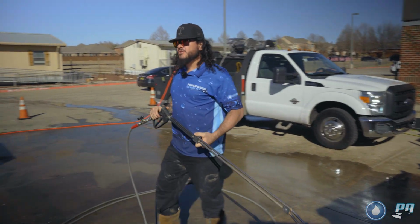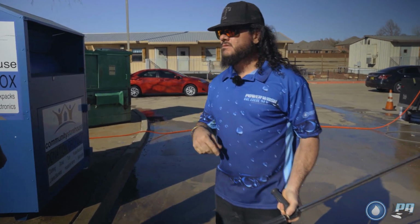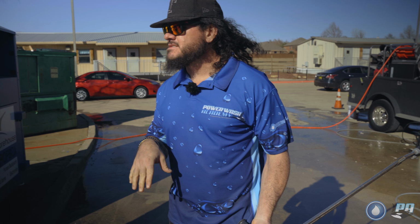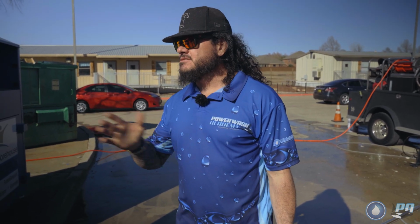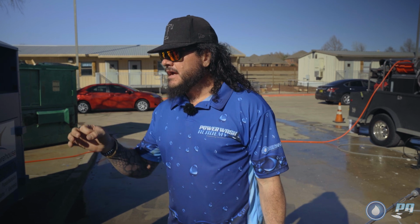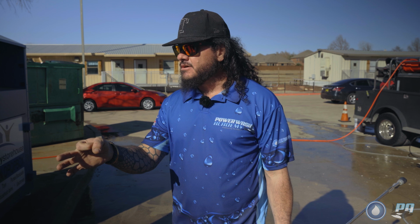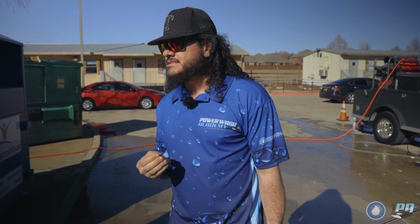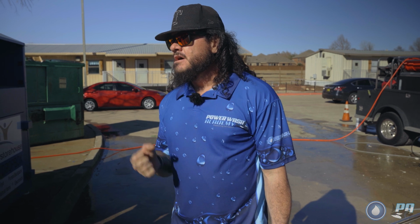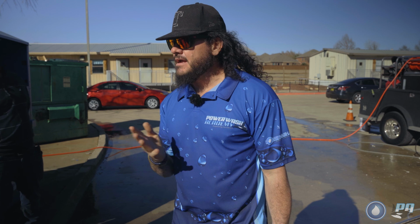There's a couple ways to remove gum. I would suggest you get a turbo nozzle to familiarize yourself with the process, because once you notice it, you'll see all these shopping centers, the sidewalks are destroyed. It etches all in it, and the gum might still be in the middle of the spot that they're going for. The heat is what softens this up to take it off. It really doesn't take a ton of pressure to remove gum. So we're gonna heat it up where it's soft and chewy again and melt it away, okay?